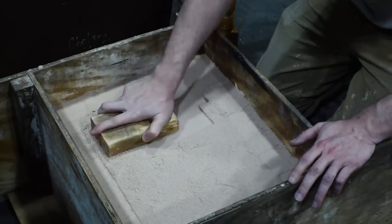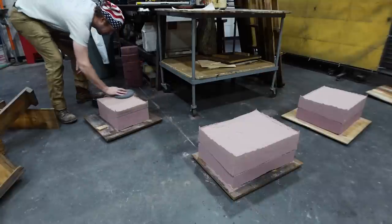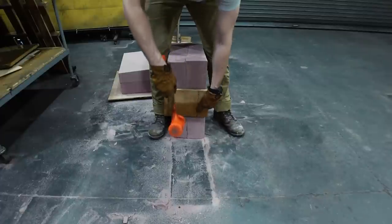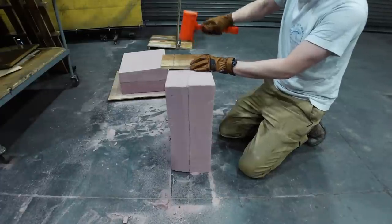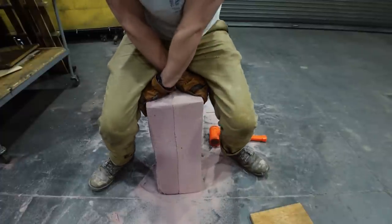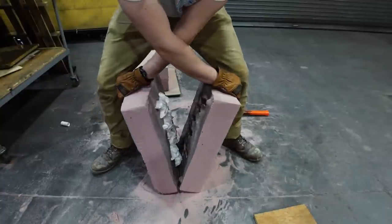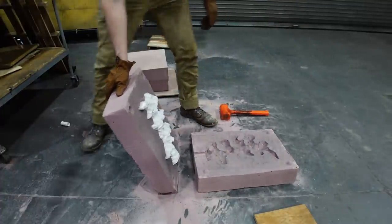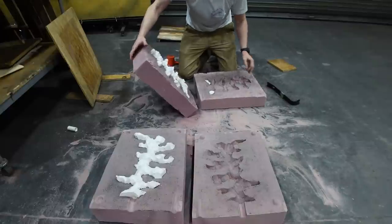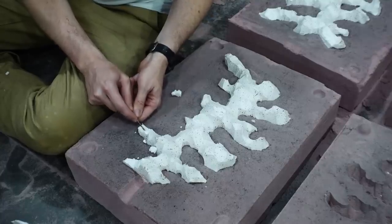It takes at minimum about three hours for the sand to set completely, so there is some time elapsed here. Some more talc goes in, then more sand — a little bit for the fine details at first, then pack it in with all your different tools. Three hours later, pull it apart again — it looks like some kind of weird sherbet ice cream, but not nearly as tasty. These were pretty difficult to get apart even though I put talc between the two halves; the styrofoam pattern on the inside was holding them together.